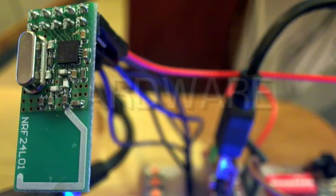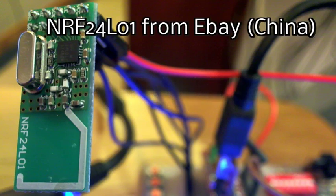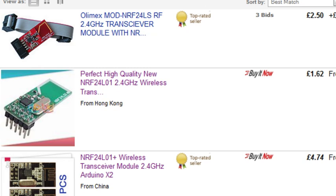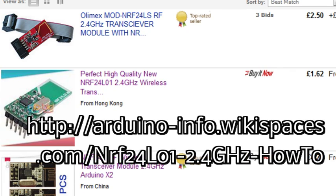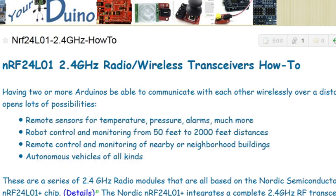What we're looking at there is the NRF24L01 — one of the ones I bought from China, a couple of weeks delivery depending on where you are in the world. Just look up NRF24L01 on eBay and you'll see those modules. I used the brown ones and the green ones. Be very careful — these work on three volts, not five volts. The signal wires are fine on five volts, but you need to drop the voltage to three volts. A couple of diodes in series with the power supply will do it.